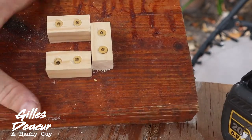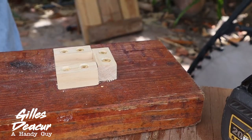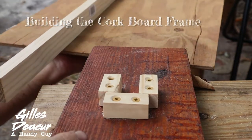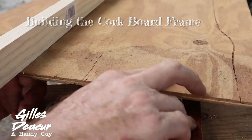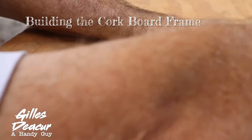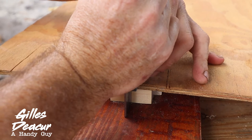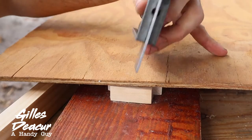Two of these pieces are the exact same length, and the third is not the same. To construct this jig, I'm going to get it the width of a cork apart — this is going to go on the end, and the other two pieces are going to have to butt up square to it. I want those screw heads to be below the surface because I'm going to be running a blade and I don't want it to interfere. That's the length I want the corks — which happens to be two widths.